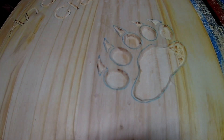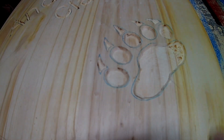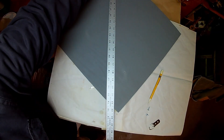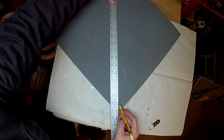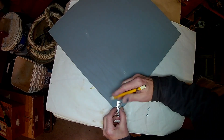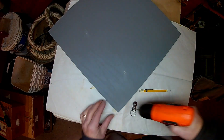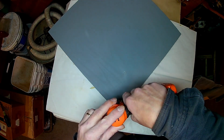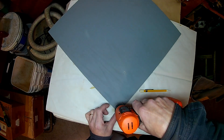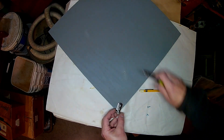The next thing will be to sand the entire board, get rid of my pencil lines and any extra blue lines, and get the board perfectly smooth and ready for painting. For the last couple of steps on this project, I'm going to strike it diagonal from one corner to the next, mark there, lay out my hardware, put marks crosswise where that ought to go, and drill this out without going all the way through, to keep from splitting anything.